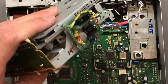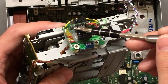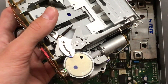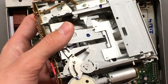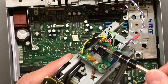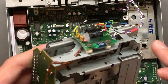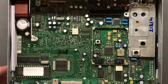On the back of the cassette assembly, sandwiched on the back of the DC-DC converter, we have a step-down converter. This motor will actually get whatever voltage is on the car's 12-volt line — it could float as high as 14.5 or even higher if something has gone wrong. So this just caps it at 12 volts, because these DC-DC converters are very sensitive — the datasheet specifies them as half a volt plus or minus over and below the nominal.